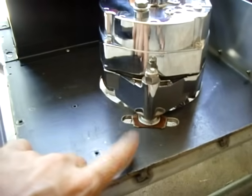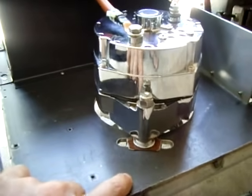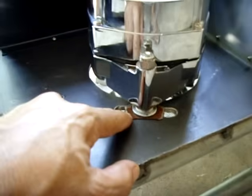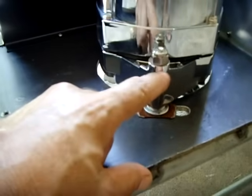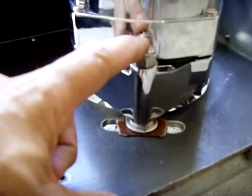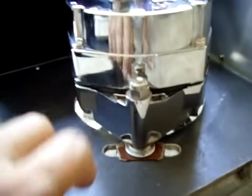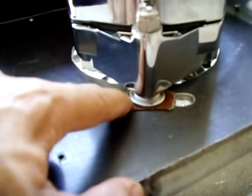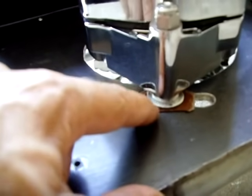After I put this all together, the engine would start and then it would stall, repeatedly. I figured something was up with the alternator. The negative ground on the alternator was interfering with the ignition on the gas engine. I also put an on-off switch right here to kill the engine. What was happening — and luckily I figured it out — is that I needed to isolate the 12-volt negative ground from the alternator from the steel plate which is attached to the engine. I did this by putting material from a head gasket between them.